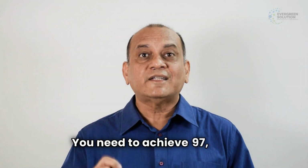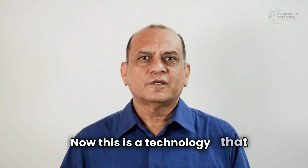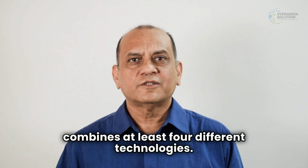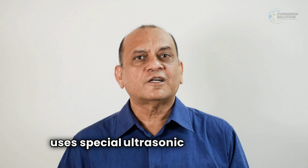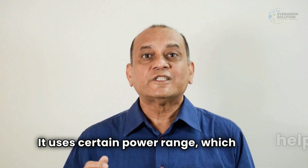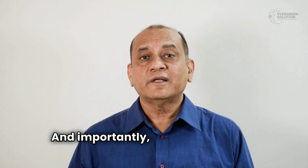You need to achieve 97 or at least 95% of heat exchange capacity. Now that can happen only when you have a combined system working together. And that's where some technologies come into focus. Pulsonication. Now this is a technology that combines at least 4 different technologies. It uses special chemistries, it uses special ultrasonic frequencies, it uses certain power range which helps penetrate even the most stubborn of dirt, and importantly, it's a mechanized operation.